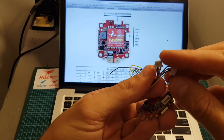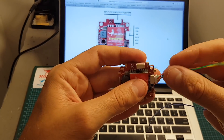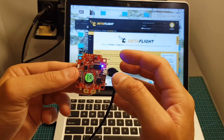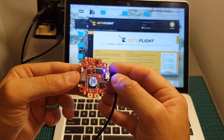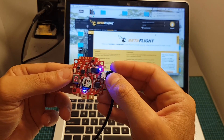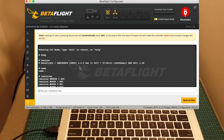You're given two of these connector types, which is convenient — for example, just remove unneeded wires and connect directly to your buzzer. When the board is connected via USB the VTX won't power on, so there's nothing to worry about. However, pressing the channel button while connected via USB won't change the band or channel — you'll only see a digit 0 on the LED indicator. The flight controller comes pre-flashed with Betaflight 3.2.3 running Omnibus F4, but the board doesn't come preset so you'll need to do the configuration yourself.